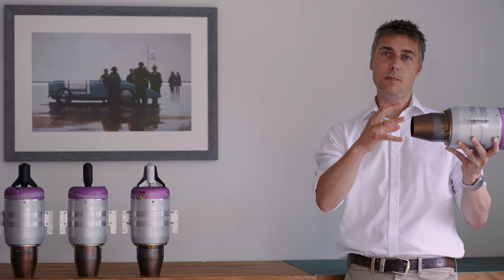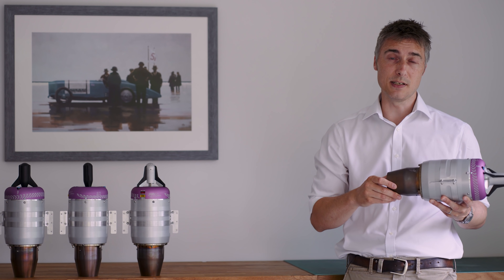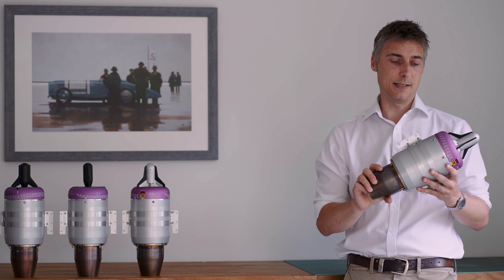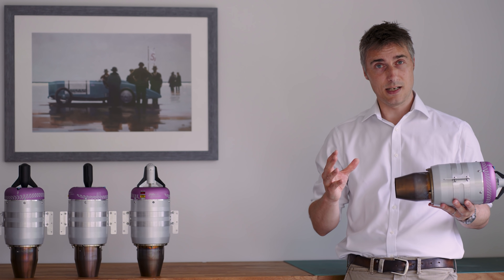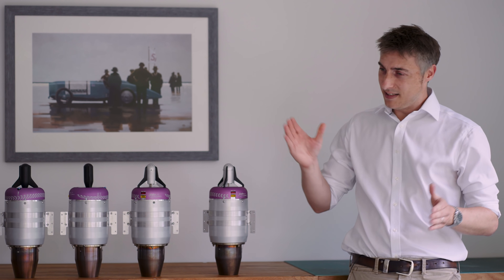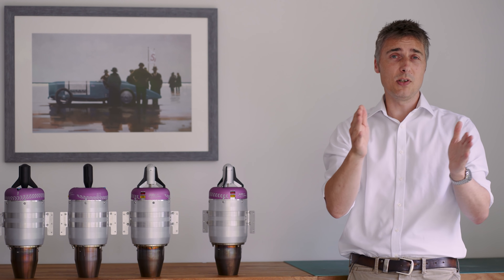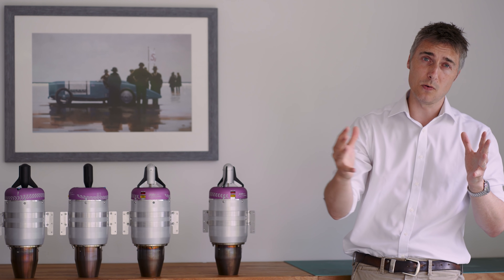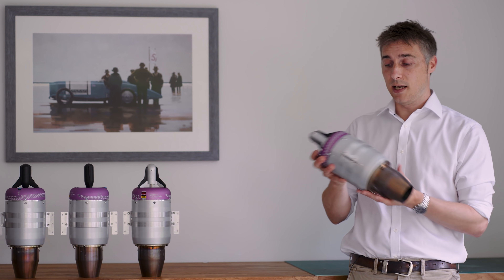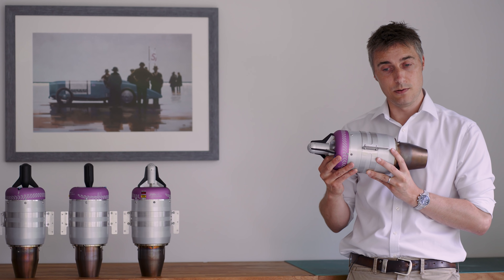That's not too much of an issue — we have a bell mouth, and by moving the bell mouth slightly aft we can avoid or reduce this suction effect, and we cannot linger on those power settings. The main issue is when we decelerate with the skis at 15 degrees. The aircraft decelerates really rapidly as the hydrodynamic drag increases exponentially, forcing the pitch very high so the back of the airplane sits into the water. Because the deceleration has been so rapid, a big following wave then rushes up the back of the airplane. In this engine's case, it came straight into the nozzle, hit the turbine wheel, and I can now play a tune on this turbine.